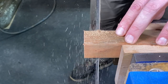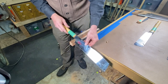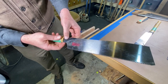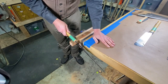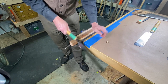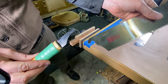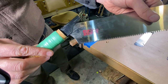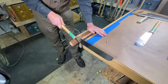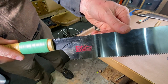Here's just another angle of the cutting action. As far as changing the blades on these saws, the blade is trapped in between two pieces of metal. What you do is on the edge of a table or a block of wood, you tap the saw blade just like this, and the blade starts to come out. You pop the blade out. Then to put it back in, you slide it in and it engages right in there. Apply a little pressure, then do the opposite — tap the back side on the block of wood — and that locks the blade right back in.